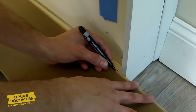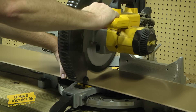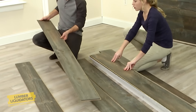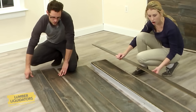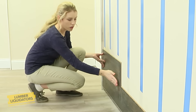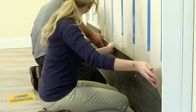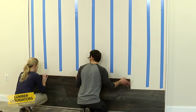Determine the length of the last plank, mark it, and be sure to leave a ¼ inch gap at this end too. Then cut that last plank right on the mark you made and install it as the last plank in that row. Open up a box or two and spread out several planks on the floor — this will allow you to select from the boards and ensure a good variety of colors. Start the second row by using the piece you just cut from the end of the first row; this will ensure a good stagger in the rows. Be sure the cutoff piece is at least 8 to 12 inches long. Continue with each successive row, including the cutoff piece from the previous row as the starter board.